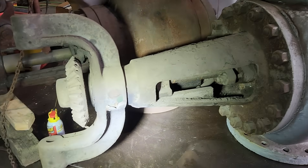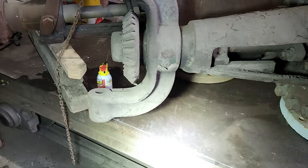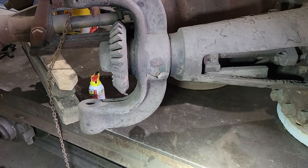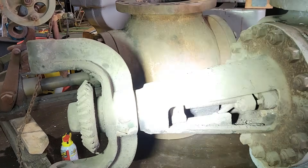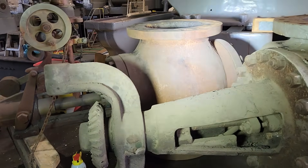Rather simple in design. There is a vertical shaft with a hand wheel that sits on a pedestal, and when you are ready to run the engine, you open it up. Generally when this was running in the mill, you would open it up all the way and then it would run up onto the governor, and the governor would control the speed.